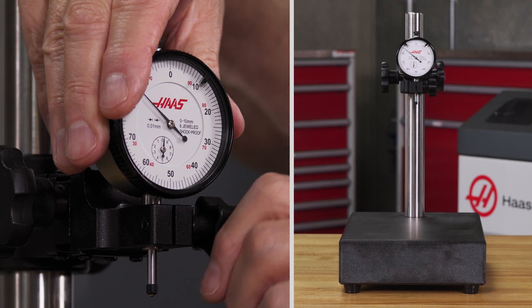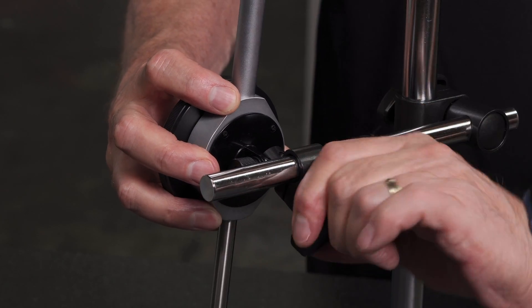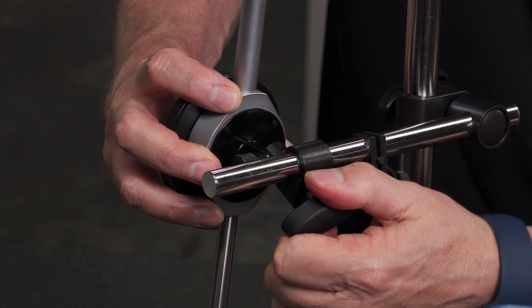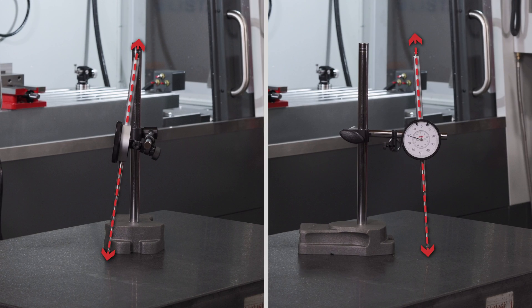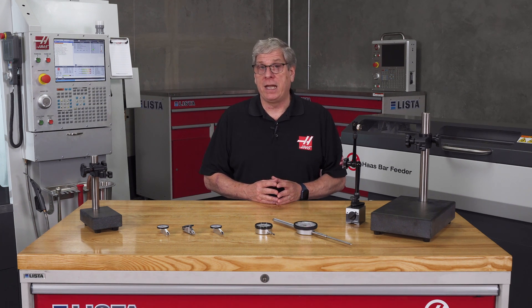But with a stand where there is a movable joint where the indicator attaches, misalignment like this or this will give an incorrect reading on the indicator dial because of cosine error. We'll talk more about that when we look at dial test indicators.